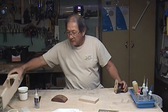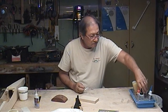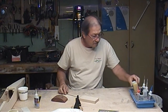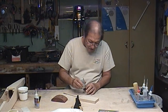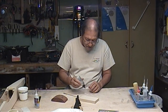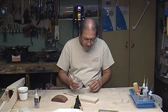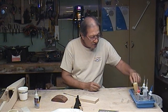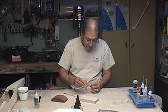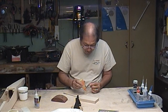I've got my handy-dandy glue tray. I'm going to use a 15-minute long-set epoxy — that gives me working time and lets the epoxy absorb into the wood better than 5-minute will. Five-minute gets on there but doesn't soak in very far, then it's hard. Fifteen minutes gives that extra bit of absorption I need into the plywood, since it's a lot denser than balsa. Using a 1-ounce mixing cup and a stir stick, 50/50 mix.